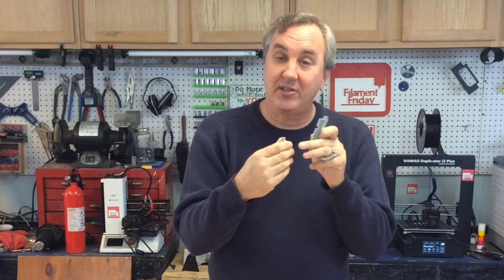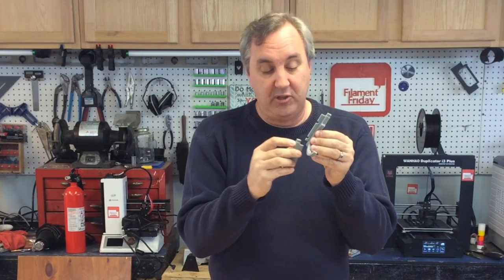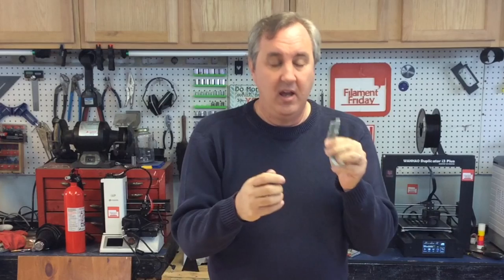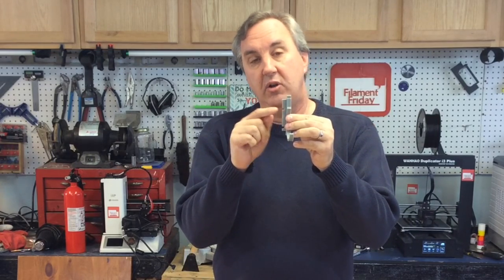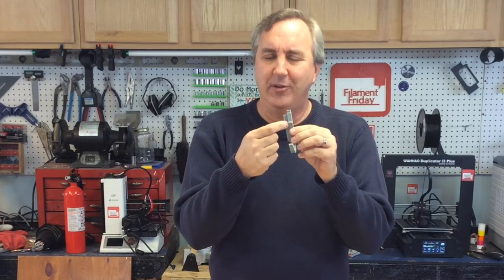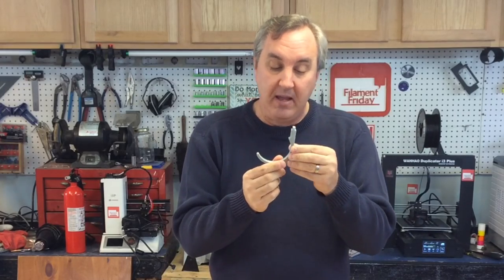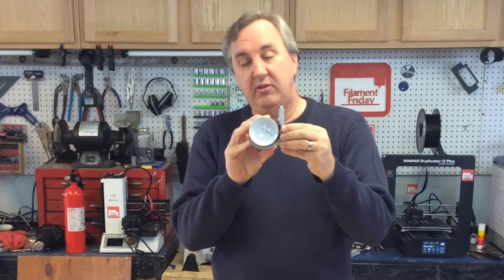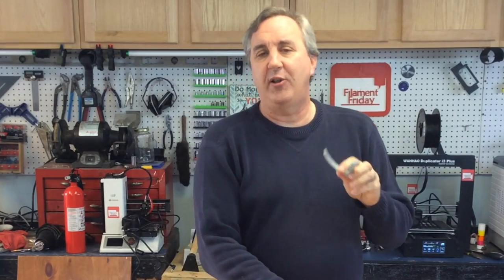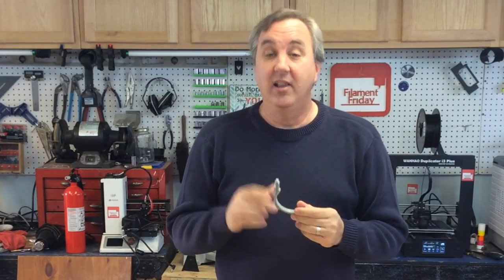You need clearance because the plastic will expand a little bit — just the ribbing of the plastic from the layers. You need to allow for expansion and allow a gap, so that needs to be changed. Another thing I didn't like is these are slots for the screws and the piece could pop out. I'd rather have a full circle to hold it in place. And the hooks themselves are slightly big for the cans I'm going to be using, so I need to shrink them down. I made those three changes in Tinkercad — let me show you how.